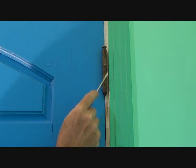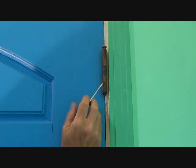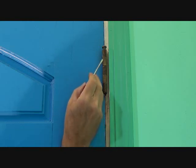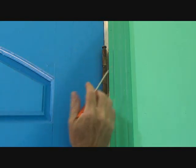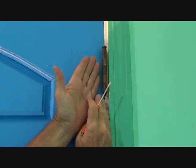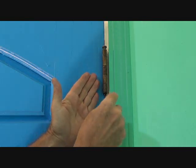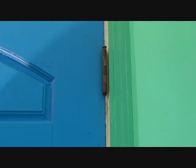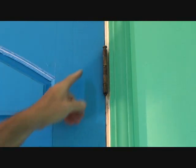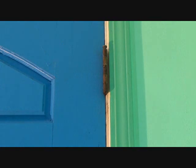So those are the two I'm going to work on. I've got to pull this door off the hinges to do this next step. I'm going to take this nib and bend it over towards the door, and this one too. When I put it back up, you'll see it's been bent over about a sixteenth of an inch, so I'll then be able to push the door over further. The other three on the door jam will hold it in place and move it over that little bit. I didn't want to do that first because I thought maybe I could move the jam over a little bit — sometimes that works — but since we have room, this is our next step. Time to remove this door.